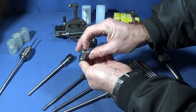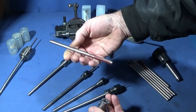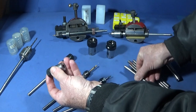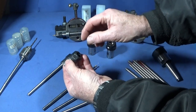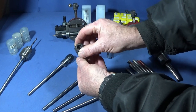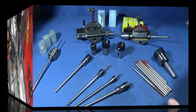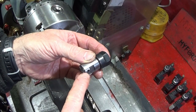I did find that the 8mm hole was a bit too tight for the ground stock — this is exactly 8mm and when I came to push them through they were too tight to fit. So I just quickly took them out on the Myford, put them in the chuck and drilled that out with a cobalt drill. These are hardened tool steel so you need a hard drill — use cobalt drills and it'll go through without any problems.